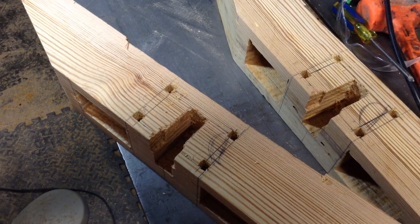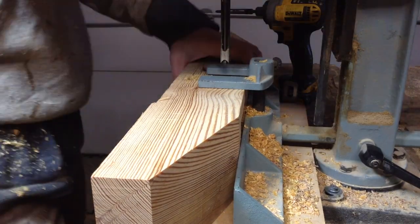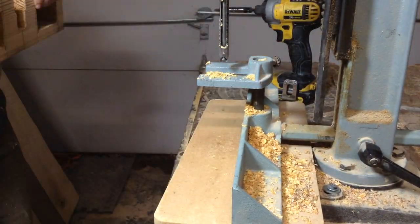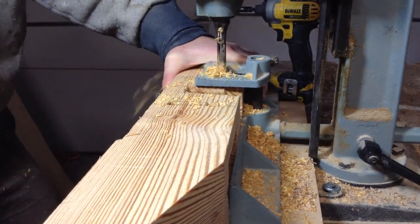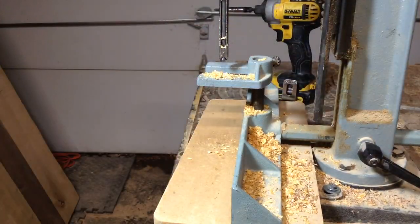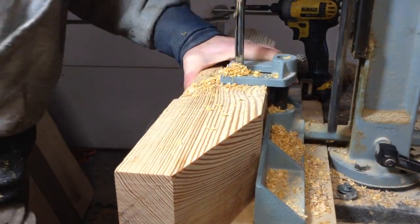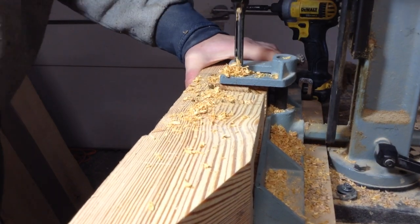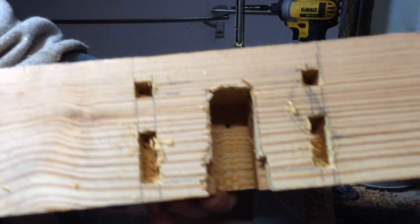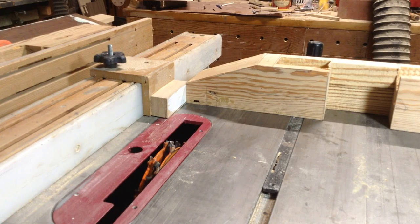I did the tops and the bottoms of these, then I move back the fence and continue making the vertical cuts. With the groove cut on the base, it doesn't match up with the fence perfectly. In the last clip I was using a screwdriver to shim it out just enough to safely cut these. I'm just working my way down, lined up with my marks — pretty simple way to make a mortise.